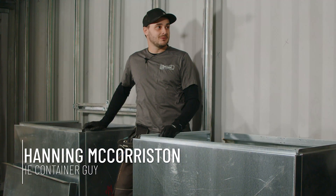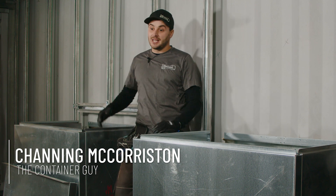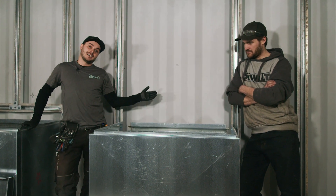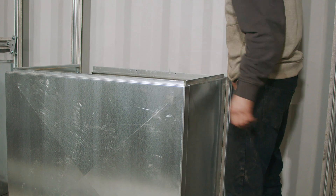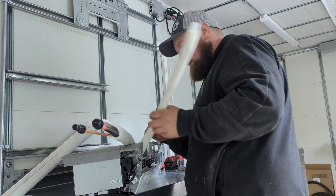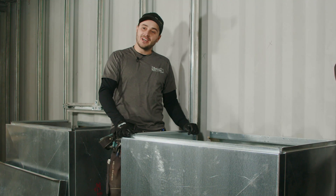We love the heat pump mini split AC units. In this instance, these containers, we had to cut them in half and send them underground. The exterior condenser could not sit outside of the container because it doesn't fit down the shaft. So we made this recessed box to allow it to take up some of the interior envelope and then give ourselves a nice workbench on top. Let me bring you over here and give you a little tour of what we've done.